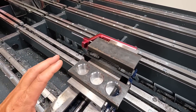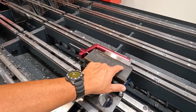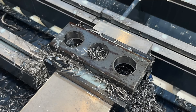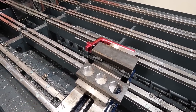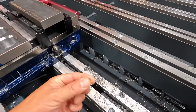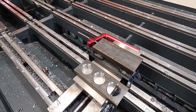The reason I wanted to go to a roughing end mill is because there's a lot of material being milled out and it was building up a lot of chips on both sides and underneath. While it's operating I have no way of clearing those chips other than the flood coolant splashing down there. So I said let's go to a roughing end mill — it makes all these tiny chips that are not going to pile up in a bird's nest like a standard four flute end mill will.